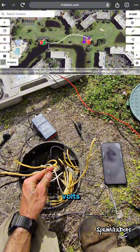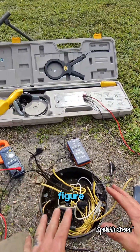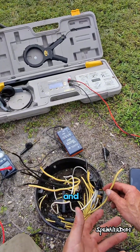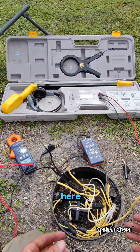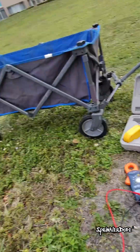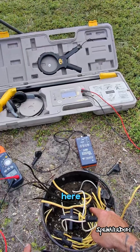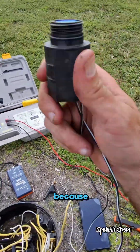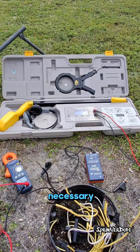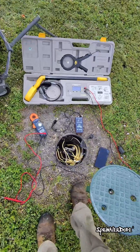As you saw, we had to use a few different tools to figure out whether this wire was good or not. We're not exactly sure why it's not — we could troubleshoot that and track down where the break is, but clearly there are plenty of other options here. We used our Armada locator to send voltage down this wire. He's using a Klein low voltage pen to detect that power at the other end. I used my Station Master Pro to make sure the solenoid was good. Even so, I still carry a brand new solenoid with me just because I know that one works. And I used a multimeter to make sure I had both continuity and voltage on the circuit. All of these tools are necessary for the troubleshooting we do on a day-to-day basis. Now that I got this one figured out, we've got to get on to the next one.